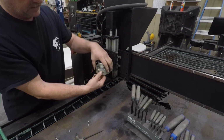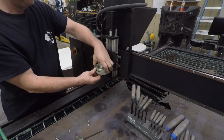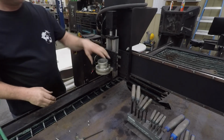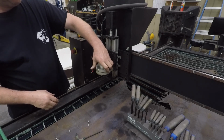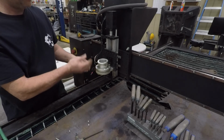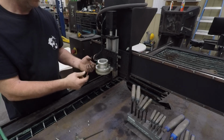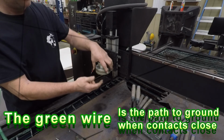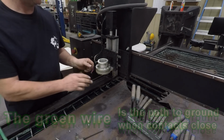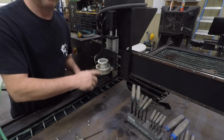And one of these is open like that. Apparently. You'd think though that some of them are still touching. I'm trying to make sense of that myself, but if one of them is open, apparently all 3 of these are going into, maybe the one on the bottom has nothing to do with that, and that's just a grounding. So each one of these is a lead going back to the controller somewhere. So if it sees any one of these as open, when that opens up the switch, then that's going to turn the contact light on and shut down the machine or keep it from working. So anyway, just wanted to explain that a little bit more. That'll be it.